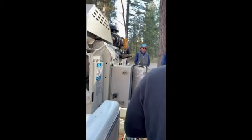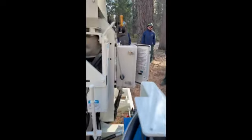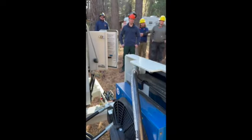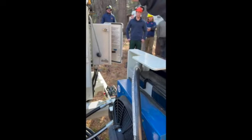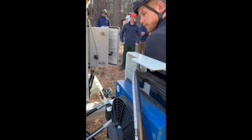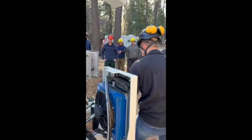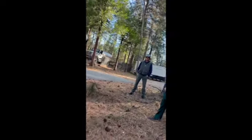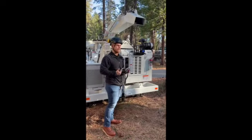With that being said, a lot of times with this tether, when you're forced to run it with this setup here, it's a 30-foot cable. A lot of times guys are off running it to the side, which is the proper way to run it. They move the machine, run this cord over with the machine. Now you're calling us to move it from the valve stack on the back of the machine. This is nothing more than a fail-safe if that radio remote goes down. Common things we see in the field: logs falling on this, machine running the remote over, battery's dead, you forget to turn it off at the end of the day, then you're forced into that tether remote backup.